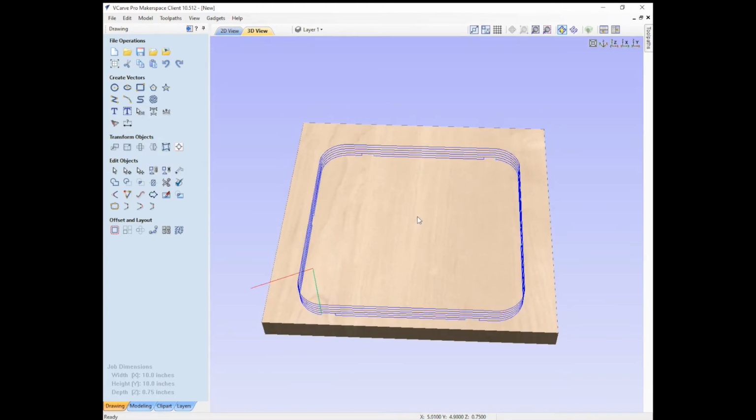And then something else that I'll note is that this is a high-speed spindle, which means that it only has much torque, has much twisting power at higher RPMs. So you really can't do very much under 10,000 RPMs. So bear that in mind, that the range is between 10 and 18,000 RPMs.